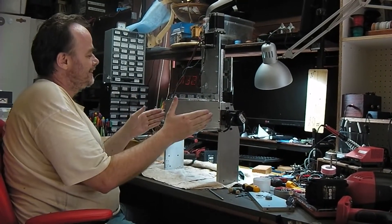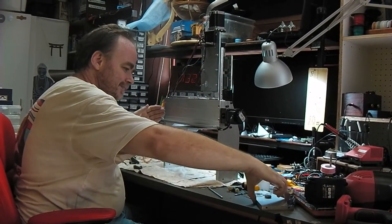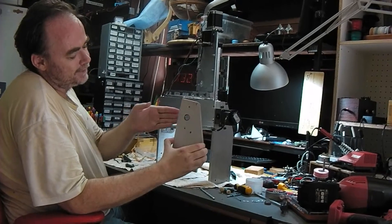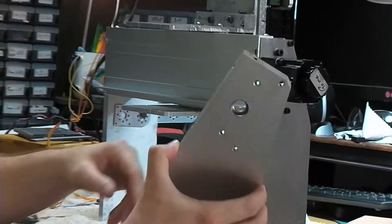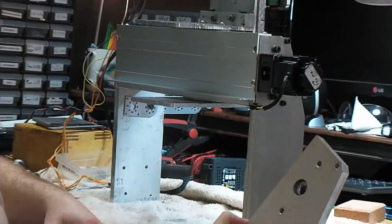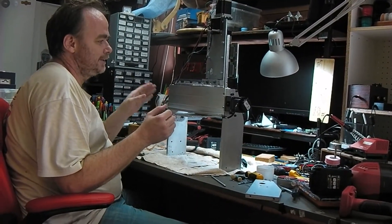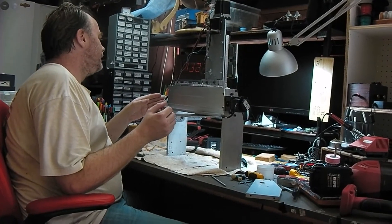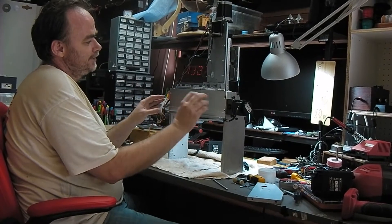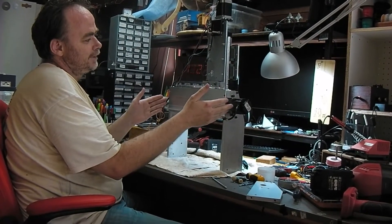The lead screw is in here. What we discovered — which caused much joy — is that this side has a very thin piece with a bearing on either side, so it's a different design to the stepper motor side. Smaller bearings as well, not skate bearings, about 18mm on the outside. So you've got fun and games if you've already got a 22mm cutout on this side for the bearings. If you jam a bearing up on this side of the lead screw once you put the bolts in, there's not enough room — it basically binds the lead screw when you put the two sides in.